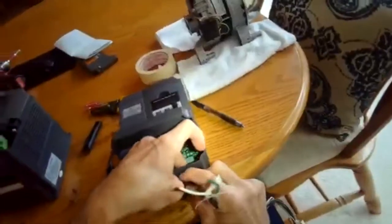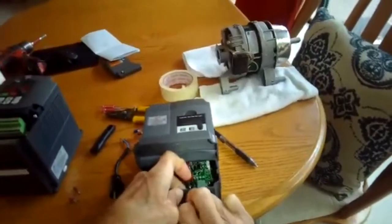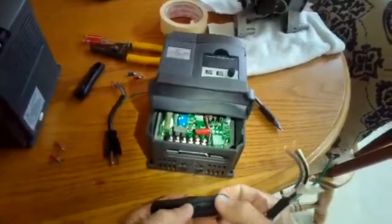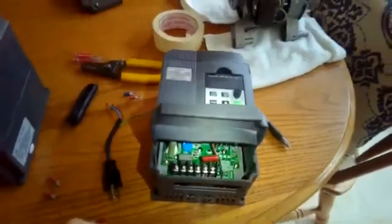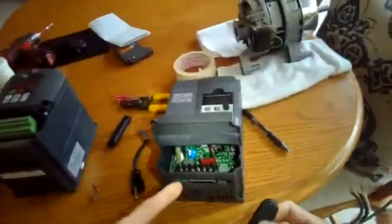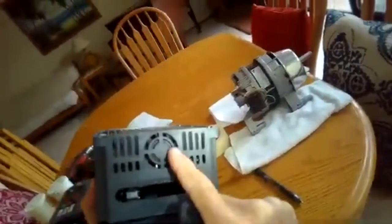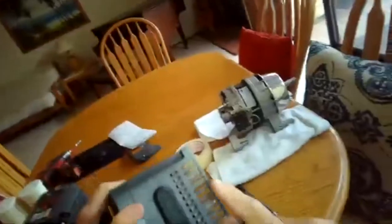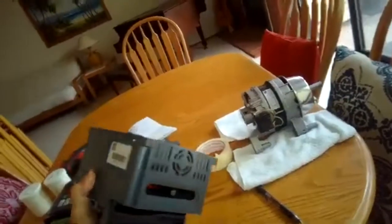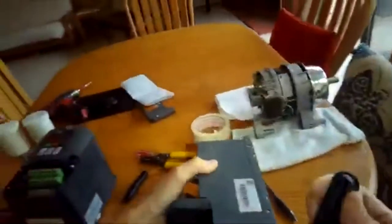First step, I'm going to pull out this little rubber boot right here at the bottom, and that's just kind of a way to keep dust out. Especially when you're using a belt grinder, you get a lot of dust, metal dust in particular. You don't want that metal dust to get into here because it can ground things out. So what I usually do with these, if I have them nearby where the grinder is, I don't cover up that one because that's the fan that's on the bottom, but I do put a coffee filter that allows airflow here but tries to keep the dust out from in here. And also I would put one here and here. So we're just trying to keep dust out, and that's the job of this thing.